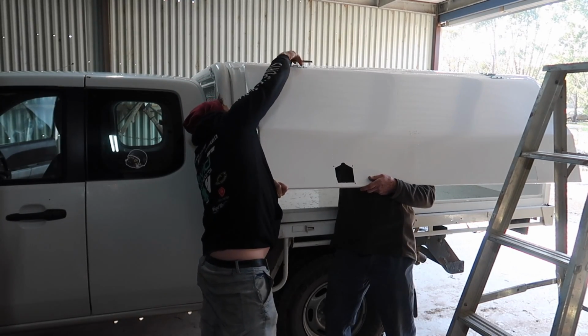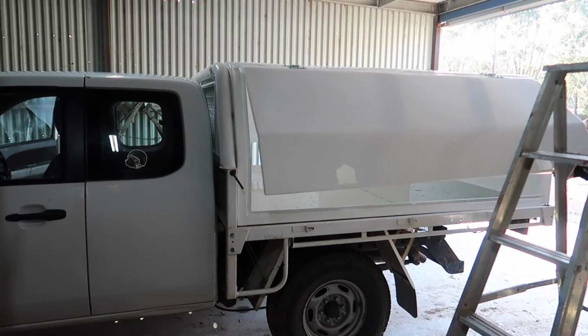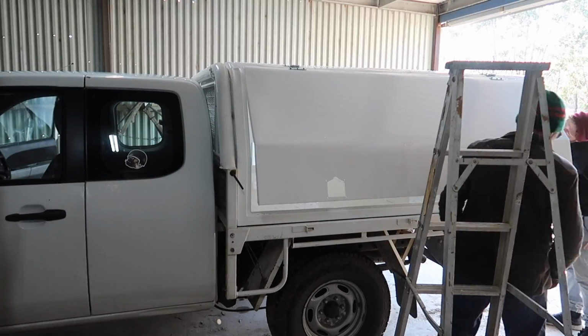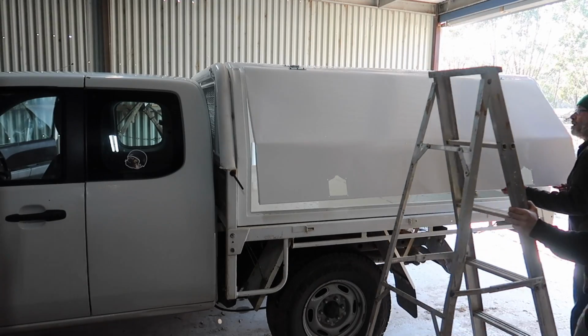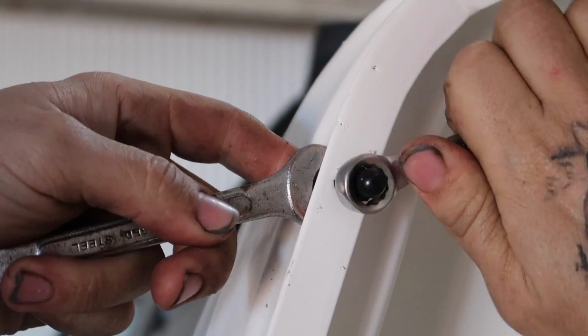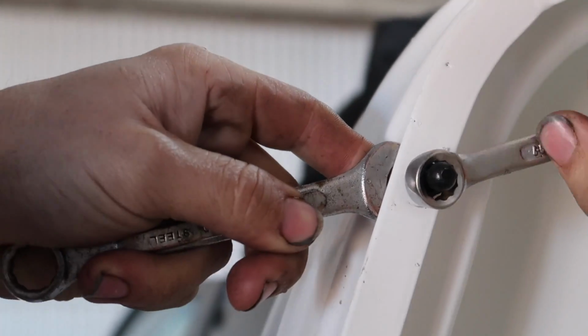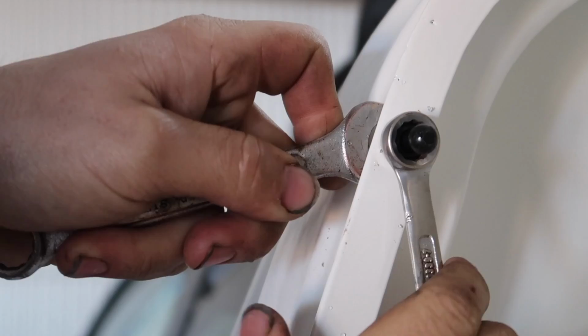So you put the first mounting ball joint of the strut on the bottom frame first. That way you can attach the door, lift it to the desired height, and then just mark where the head of the gas strut will intercept the bracket. And that means that you're not hanging off things trying to get the right heights. So yeah, the bottom one first, which is what you see, and then the door, and it's quite a bit of an easier way to set it up.